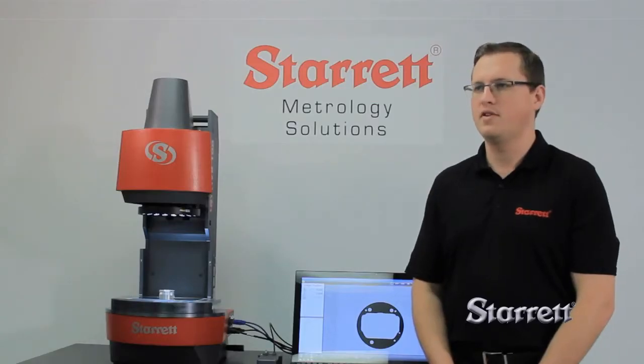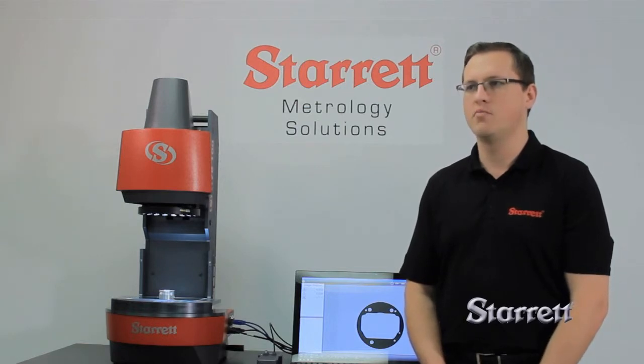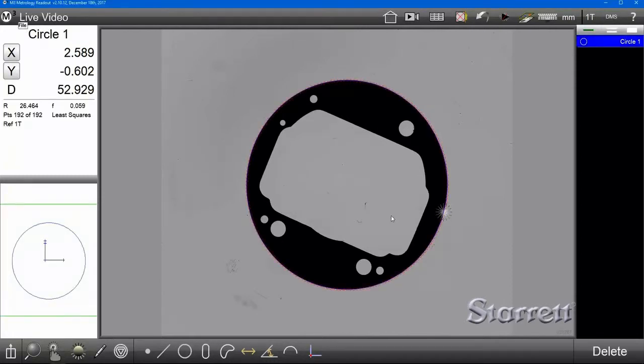Next, I'd like to show you how to set up a simple parts program. Essentially, we'll be doing the same types of simple measurements we were just showing, although this will be part of a formal program that you can pull up and use at a later date. The first thing we'll want to do is measure some datuming features. For instance, I'm going to measure the largest outside diameter and these two smaller circles here.